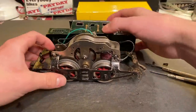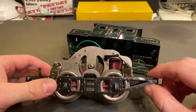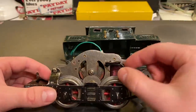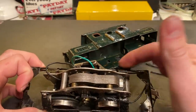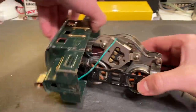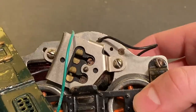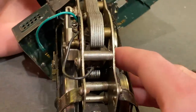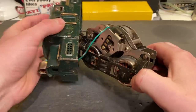There we are inside. And right off the bat, those coils are looking mighty crusty. I really hope those are still good and that's not our problem — I feel like we still would have heard some sound or something from it though. This wire looks a little suspect too; it looks like that was the wire which was replaced. I'll check the connections — sometimes people just tie things together without soldering them, so that could be one spot to look for problems. It also looks like the brush springs are not exactly where they should be. Are the brushes making contact with the commutator? There are a couple of potential problems to investigate, so why don't we start there.